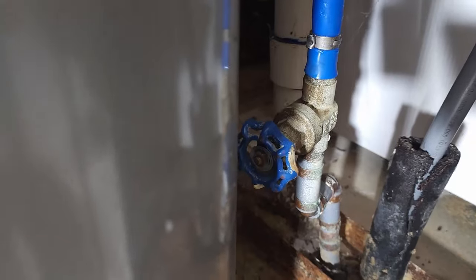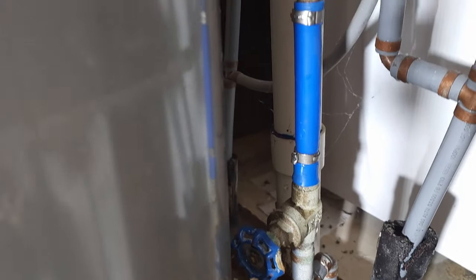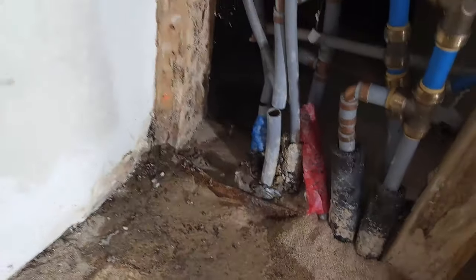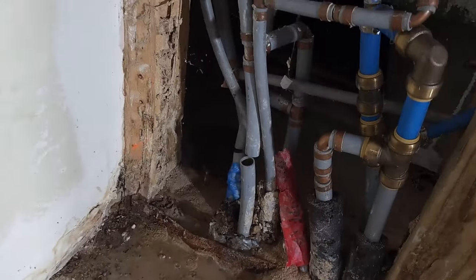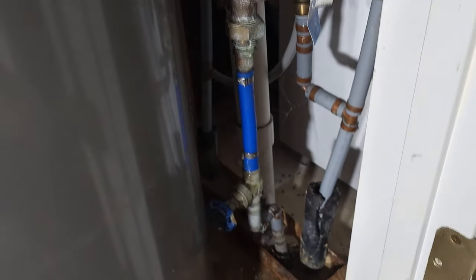Here's what we found so far. It comes in through here — that shutoff valve does not work, so I'm going to eventually be removing that one. We come in through the pressure reducer, and that's why they put that shutoff valve in. From that shutoff valve, it goes back into the ground. I got it cut loose here and found the main line — so as you can see when I turn it on, that's the line we're going to be capping temporarily and running through the attic. I'm going to remove that shutoff valve and run a temporary line.